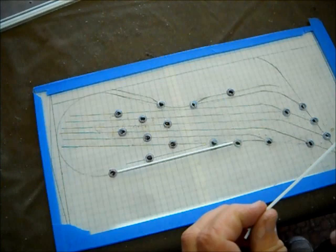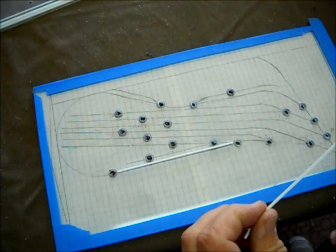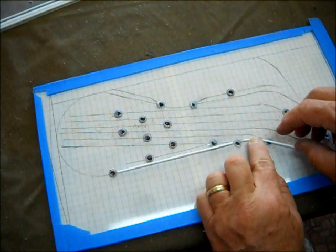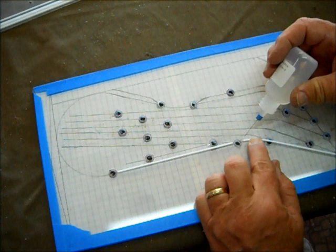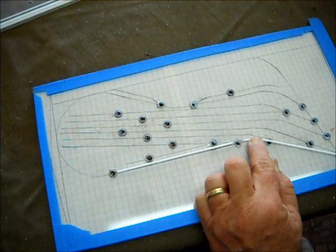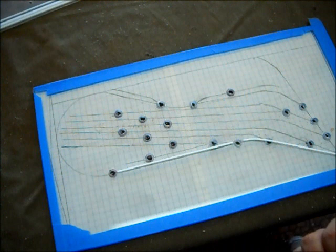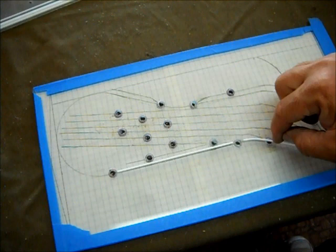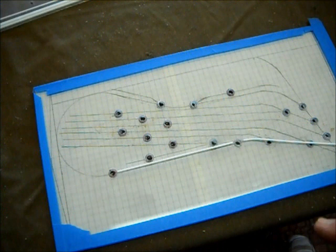This is the same plastic we're going to use to make this little radius here. I'm going to start by just bending it in my fingers — it's pretty pliable, get it to a general bend, doesn't have to be perfect. Then we're going to lay it down on the edge of our hole, remembering we have to leave room for the nut. We're going to do the same process — hold it there for a few seconds until the glue gets hold, make sure the glue is holding, go back again and apply a bead to the other side, and let it sit for a few minutes. Now I'm going to take you over to do the large radius.